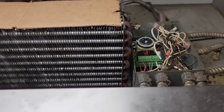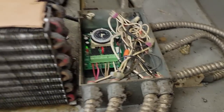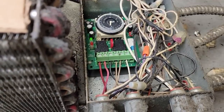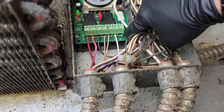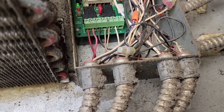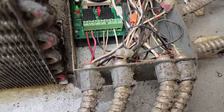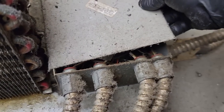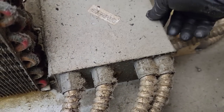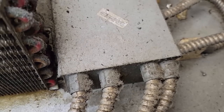I've been really happy with that Viper coil cleaner — it's not always perfect but it's done some really good work. Went into the defrost clock — they had it set to 45 minutes on almost all of them. They don't have a termination thermostat hooked up, which isn't ideal, but it's been like this for a while. So we're going to do two cycles at 45 minutes and two at a half hour, with the shorter ones during their normal business hours so customers don't think something's wrong.